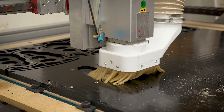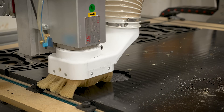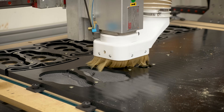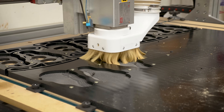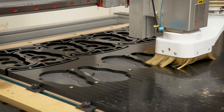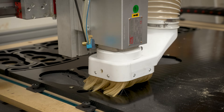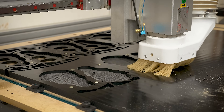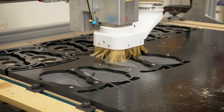One of the nice things about making your own parts in your own shop is you can pick and choose how you want to do it. A machine shop would most likely take a larger block of UHMW, face it down to make sure the thickness is exactly right, maybe make some fixtures, do two sides of it, cut them out from the back. We don't really need to do any of that — we can put in a little manual labor at the end. This UHMW is relatively consistent in thickness and well within the tolerance Luke needs, so we're not facing it down.